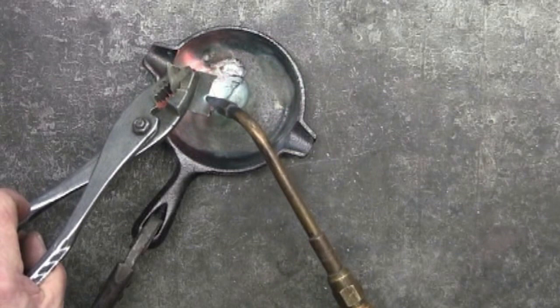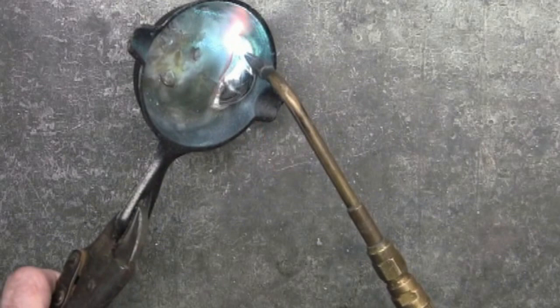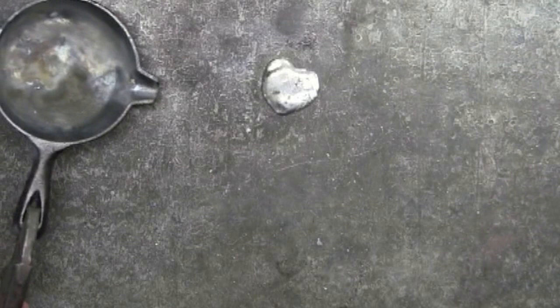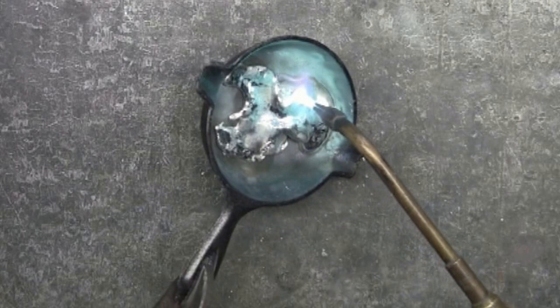Let's see how easily it's just melting into the ladle. Melding what I've got going in and then keeping what I have in there so that it is molten — I want this to be liquid. I can just pour it out. In this example, I'm just pouring it out on the welding table. This is free-forming — not trying to get any particular pattern or design. One of the great things about working with this pewter is that if you don't get what you want, you can just throw it back in the ladle and remelt it with almost no loss of material.